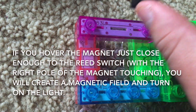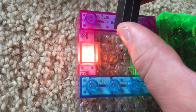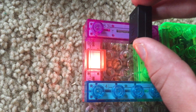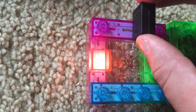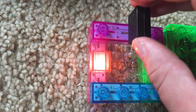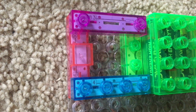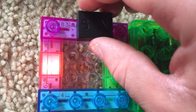You don't even have to contact the reed switch to turn the lamp on — it will just light up. When the magnet is just close enough, the lamp activates. When you take away the magnet, the switch deactivates and the lamp turns off.